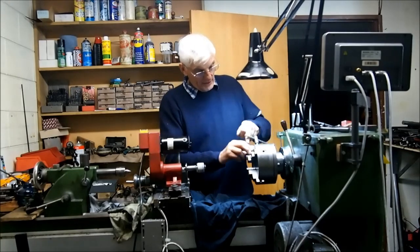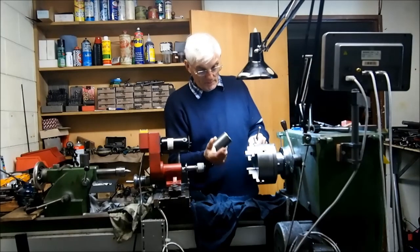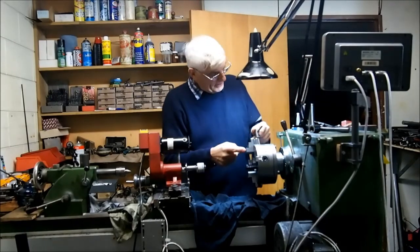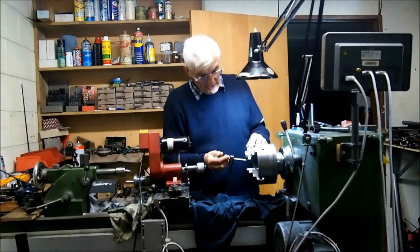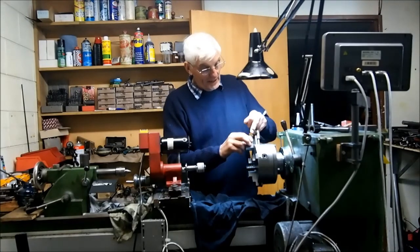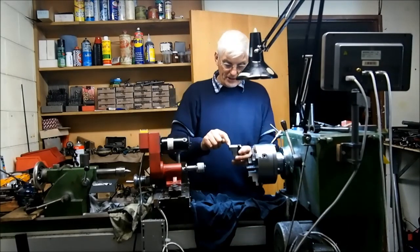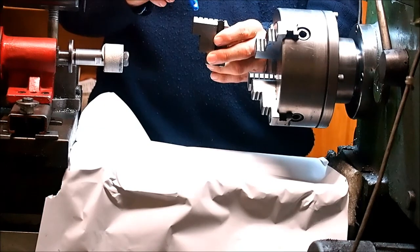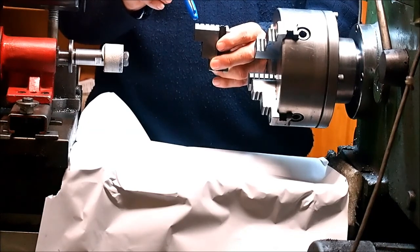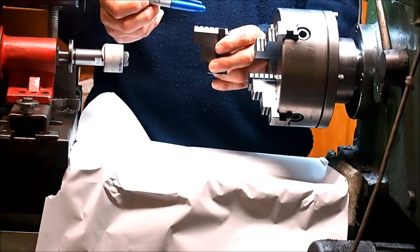The first thing that I do is chuck a piece of bar — a 2-inch precision bar — in the jaws. We find, to our horror, that all of the jaws are bell-mouthed and the error at the end is up to ten thousandths. Some of these jaws have got a ten thousandth error at this end. This is number two jaw. There was daylight at the outer end. In this particular bar there was a ten thousandth error between this end of the jaw and the bar.